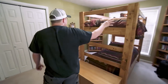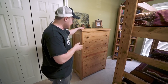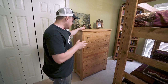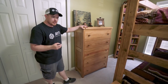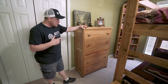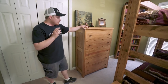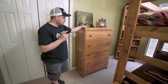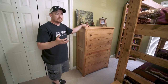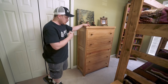This is a chest of drawers made from 2x10s from Lowe's. I cut out all the knots and used as much straight grain as possible — very clear, inexpensive pine with the same rustic pine wax finish. How is the wax holding up? It's wax, so it doesn't hold up great, and I knew that going in. These haven't had much abuse since it's the guest room. The solution is just to re-wax them — it has that feel of old antique pine furniture with a lot of use, which is what I was going for.